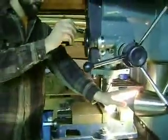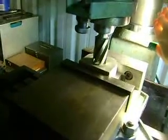Over here on the front I measured — first I measured the depth of my hole here and it's six millimeters. I went right down until I hit the beginning of the surface of this and that is at 26 millimeters, so I'm going to go down to 20 millimeters and then bore down six millimeters and be flush with the hole her dad previously cut. I'm going to back it off a little bit and get it started.